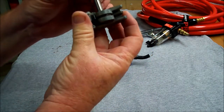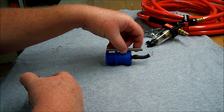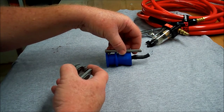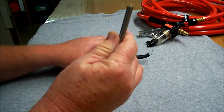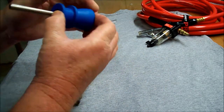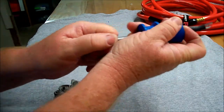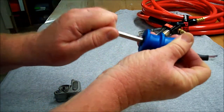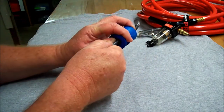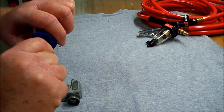You do have to go in the tank, take a tubing cutter, take the tube out, cut off the exact length of the filtration setup, which is the length of this tube right here. It looks a little longer because of this apparatus I got on it to sort of shield what I got going on here. But this right here is plug and play. You cut it off, you take this right here, and you pop it right in the holder, and it's firmly fit to the tube in there. And when you get ready to clean it, you push the little tab down, pull it out, back flush the filter, pop it back on, and you're good to go.